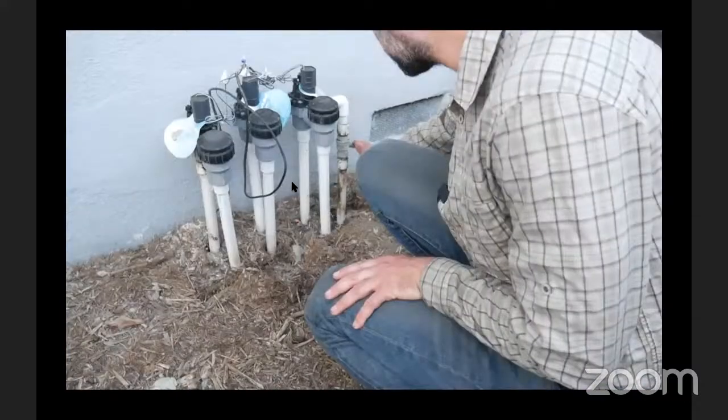And so it's kind of two things at once. The first thing you need to do is make sure that the water going to the valve is off. If you are lucky, it will have been installed with an isolation valve, so from the main line, you can turn that off. You don't need to turn off the water to the whole house to do this work, especially because there's going to be some gluing on the side where the main line is.